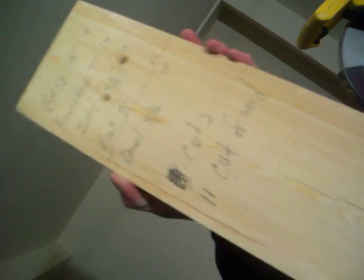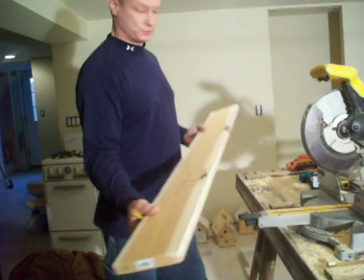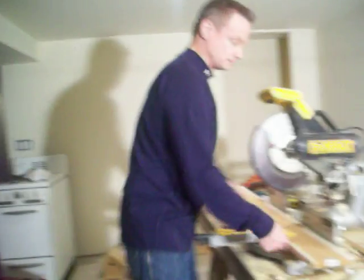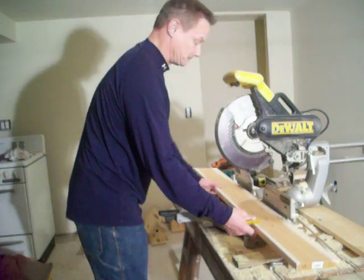These are the cuts you are going to be making — eleven cuts. From our material list, we are going to be using a one by six piece of cedar, preferably pine, but this birdhouse will be cedar. You are going to need a dowel rod, five-sixteenths. This cedar is fifty inches long — start out with fifty inches and you are going to make it in eleven cuts.